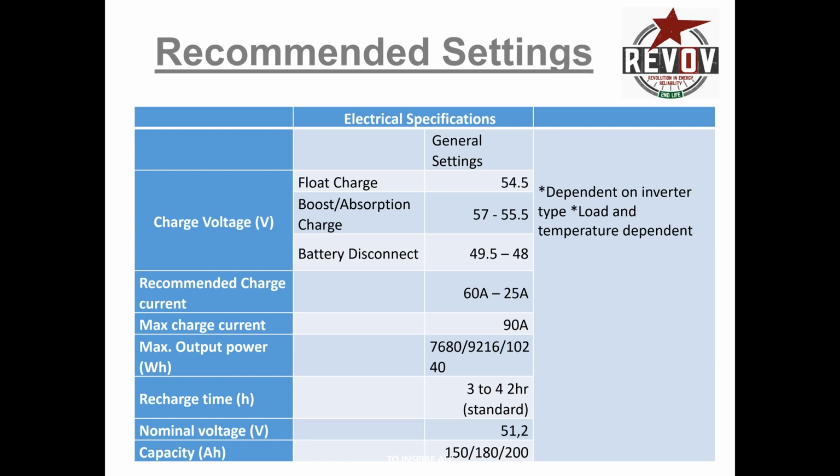So syncing up all the different monitoring systems on the inverter and the BMS is quite important. Every cycle should try and get into that absorption and float state. I'd like everyone to recognize that you want to spend 3 hours charging and another hour in float and absorption, and by then you're already at 1 o'clock and your sun is starting to go down. So bear that in mind in terms of your amp selection.